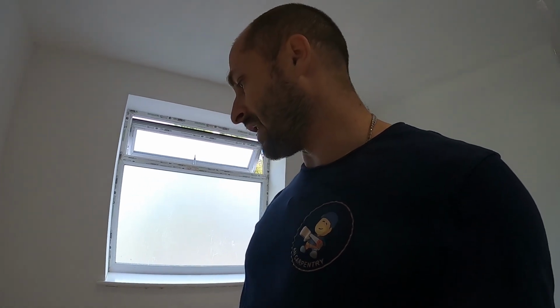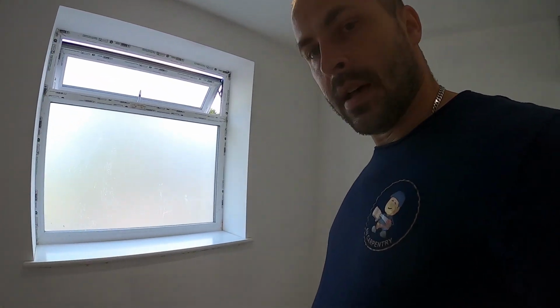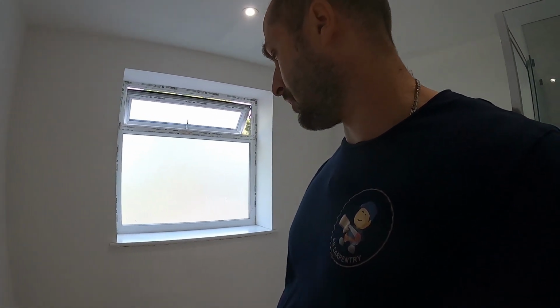But apart from that, it's somewhat similar to laying a laminate floor, or any flooring, it's just thinner. The process will be very similar. The only difference is with this click system, you do a row at once, and then on the second row you click the short ends together, and then take the whole row and click it in place. That's the only difference compared to, say, engineered flooring, where you do a board at a time and put adhesive on, or even if you float it, you need to put PVA on the joints. So that's the difference. This is all dry, no adhesives, nothing.